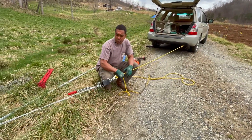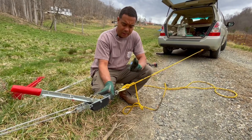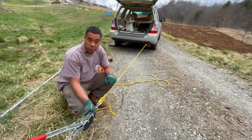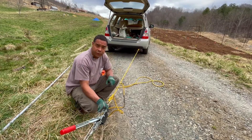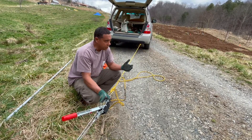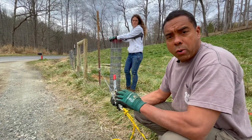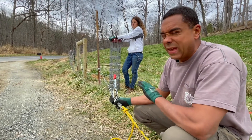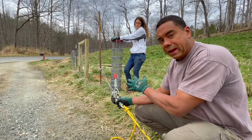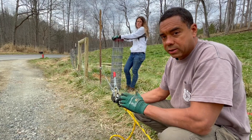We're going to do a comprehensive farm knots video — I've got a cat's paw right here because it's a middle-of-the-line knot that can handle pressure and doesn't need a rope wrench to undo. At the vehicle anchor I used a bowline because it's an anchoring knot — a round turn with two half hitches would work too. Without a tractor, if we're in the woods we use a tree, or back-to-back T-posts, or a corkscrew anchor. It works just as well, it just takes longer.